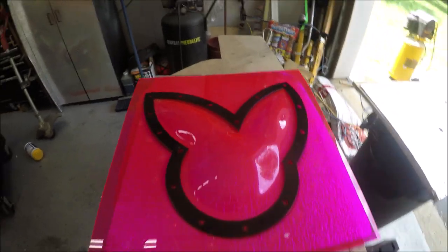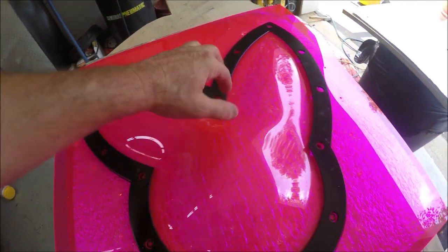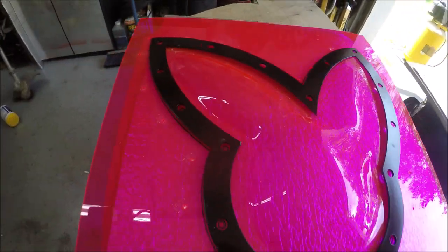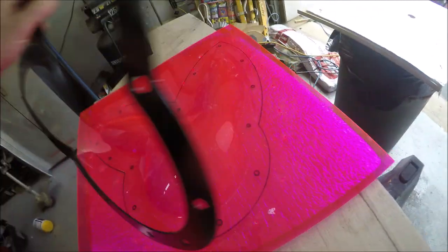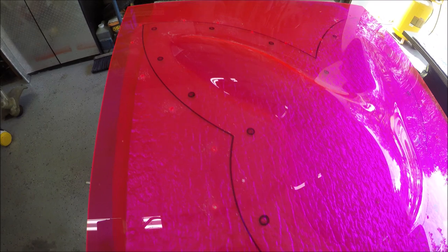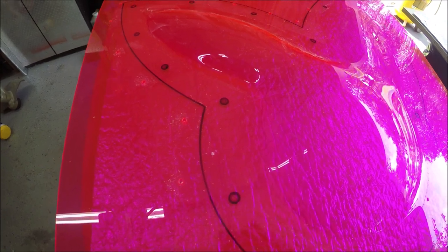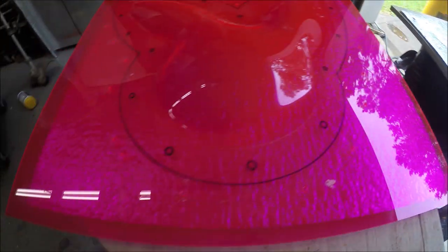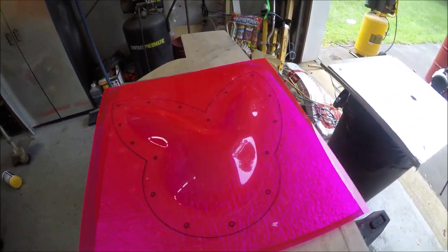Now that we got this far, we're basically going to lay it down and center it up. I used my fingers, made sure everything was pretty symmetrical on both sides — about a thumb's length all the way around. Laid it down, hit it with a sharpie, and basically just came out with all my holes — and we're going to need to cut it. What I'm going to do is drill all my holes first, because cutting can be a pain, and drilling is when you're going to crack it if anywhere. So if I happen to crack it, at least I didn't waste all the time cutting it. Start small and work your way up with the holes — cut these slowly. You do not want to crack it once you get this far.